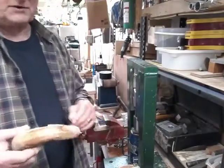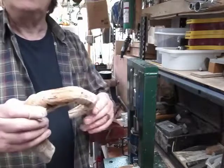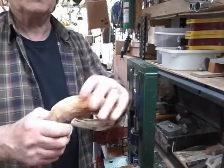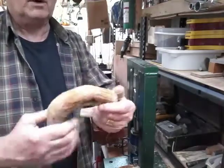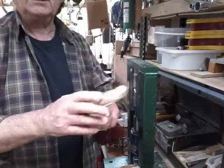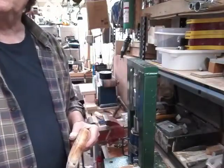I've squeezed up quite a bit. I'm going to put a slightly bigger shell in now and start working backwards and take some of this material down a bit more. What will also happen as we're squeezing up, we might just gain an inch or two in the length of the horn, so that's not a bad thing. Back soon.